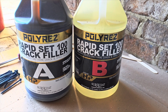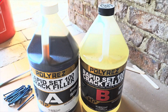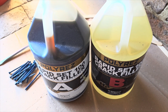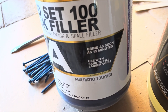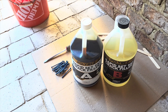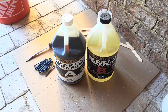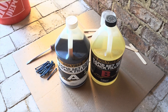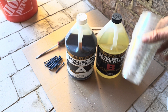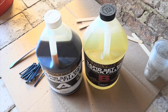This is the crack filler we like to use - it's made by Surf Coat. We use their sealer, their dyes and stains and products - love the company, love all the people there, they have great products. This is basically a one-to-one ratio: one part A, one part B. You mix it up and it ends up looking like watered-down Coca-Cola. You do not have much time to mess around - grindable as soon as 15 minutes. Use with sand to fill larger voids, which is basically what we did, and that also acts as an aggregate for the material to lock in and bond to. Some people use 100-solids epoxy mixed with Cabosil, but we like this stuff. These little cups - you can't mix up too much because this stuff sets in about 15 minutes, so we just do enough to fill as much as we can and then make more.